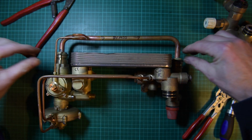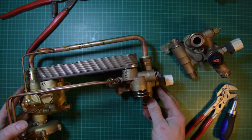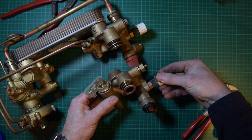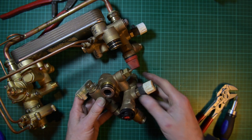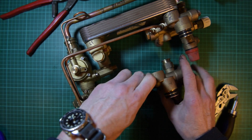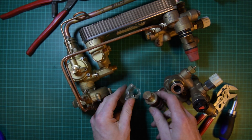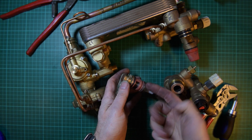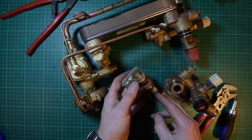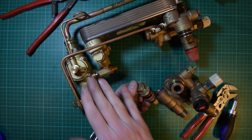The pressure gauges are on this side — these are normally held on with a couple of clips here to hold this in. You'll drain there. And as a variation, it's got the pressure release valve at the front, drain here, pressure gauge — rather than having a style of diverter, it has a flow turbine in here. This has a hall effect sensor; it sits on the top, rotates, and gives you the demand for hot water, then it actuates an electronic version diverter instead.